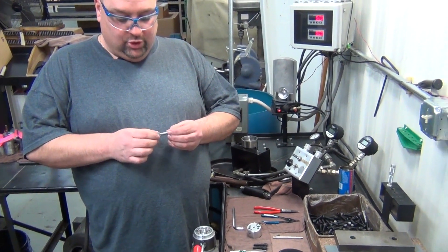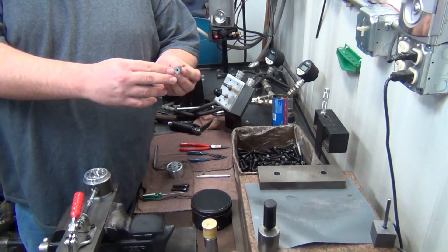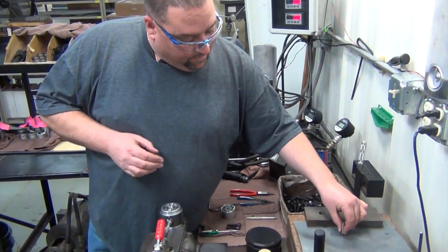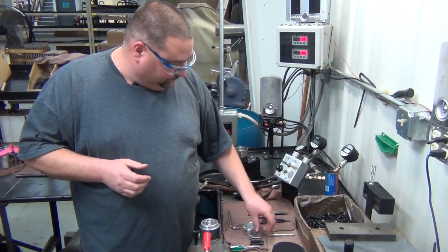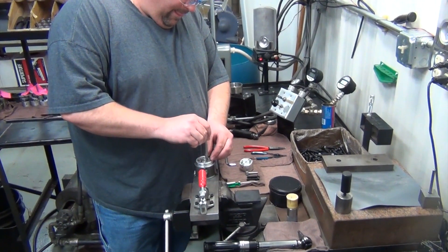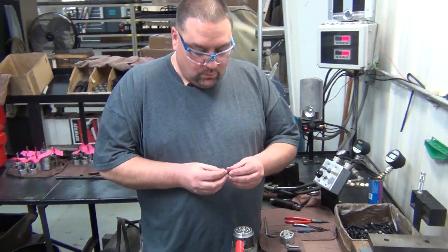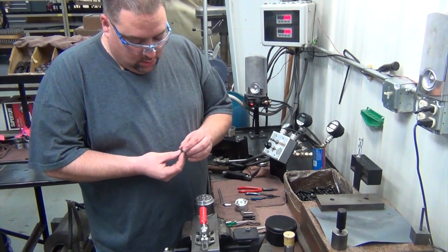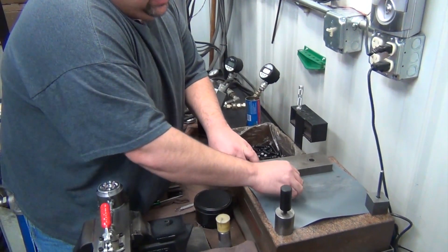After determining your drive gear is good, take it over to the 600 paper and sand the top side of the gear to knock off any burrs, chips, or anything that could have gotten in the gear. Then remove the idler gears using a magnet. Pull these gears out and visually inspect for any wear, debris, or chips. Take them to the 600 paper also and smooth out each side, then visually inspect again.